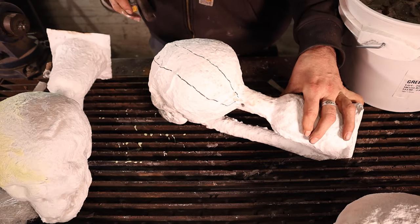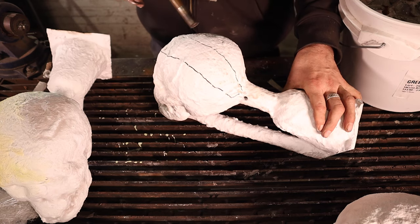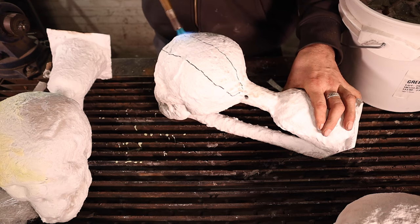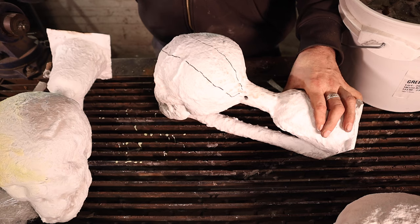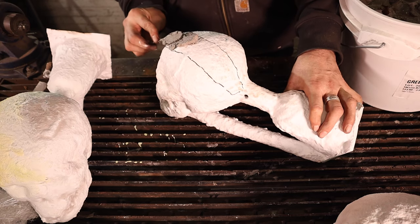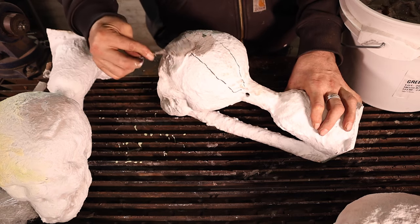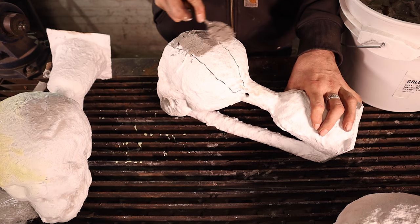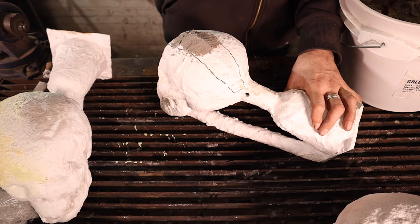What I want to do is use the propane torch to actually heat the surface. Depending on the size of your crack, if you can do it all in one swipe that's cool, but if need be, heat just one area — in this situation I'll do half the crack. I like to apply it straight on the crack so I know I have good adhesion, almost working it into that surface, and then feather it out, creating a little bit of a ridge right up over the crack. I found that to be the most structural.